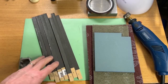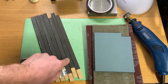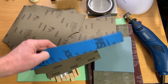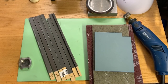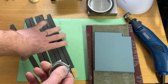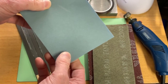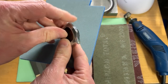These are abrasive sticks — they come in all different grades from quite coarse to really fine. It's basically just wet-and-dry silicon carbide paper stuck to a stick. I've also got many different grades of sandpaper here: 800, 400, 320, and 1500 grit. I use a lot more paper than sticks. I've also got this sponge-backed abrasive which acts at about 1500 grit — it's quite good for nice round parts.